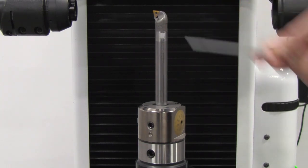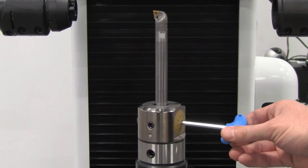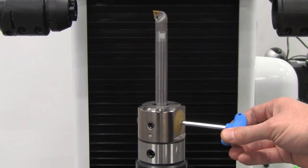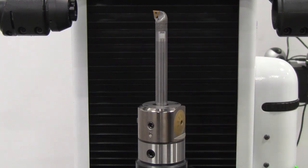The total boring range of the assembly is reached by adjusting the boring head back and forth to offset the bar from the tool center line. This offset amount affects the balance of the tool assembly, and greater offsets mean greater unbalance, which can limit performance, especially with deep boring depths.